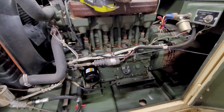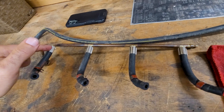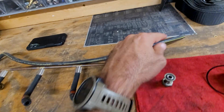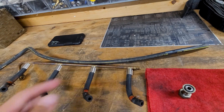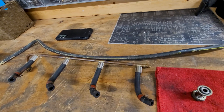I'm going to take a break and have lunch, and then I'm making the repair on the fuel line. What needs to happen is you cut these crimped pieces, then cut new hose to length, put them on the injection pumps, clamp them into place, put this fitting in place, and use hose clamps up top.